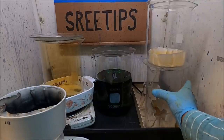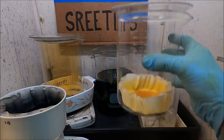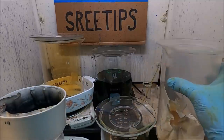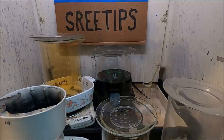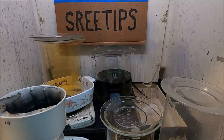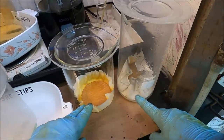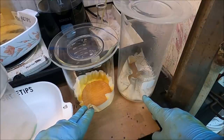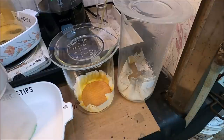And then last but not least, we've got our two beakers that have our palladium precipitate in them. And in the next videos, what we'll do is we'll combine these, dissolve these in aqua regia, and then get some pure metal out of these. We're making some great progress towards getting all those values concentrated together so we can do a recovery.